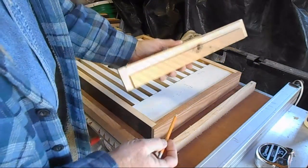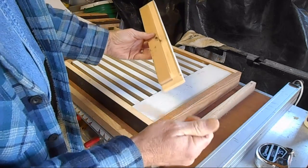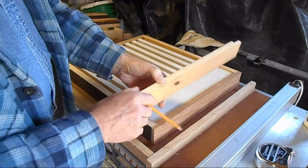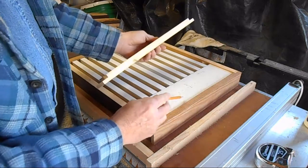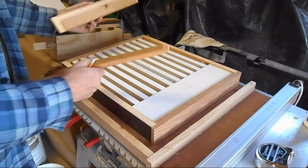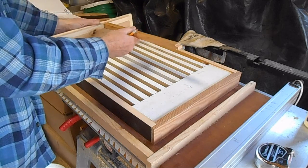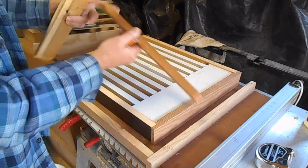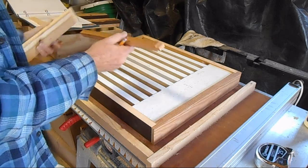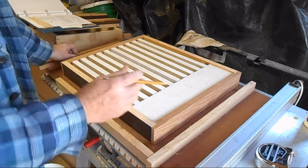The height here I use two and a quarter inches. There is a dado here for the side rails and then there's a dado here that holds the shelf. This dado here fits the rail or the rack and it fits in just like that. This end of the rack is squared, and this end of the rack has a tenon on it, so it just fits in there like that.